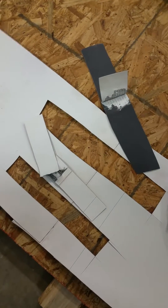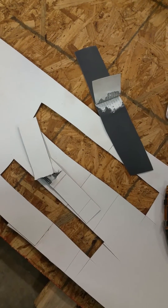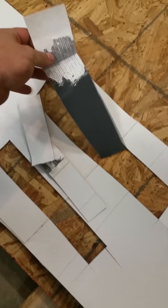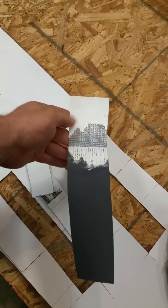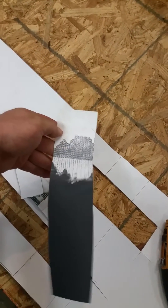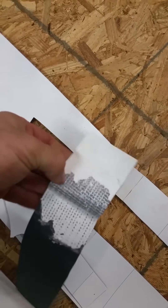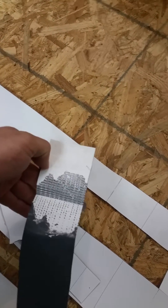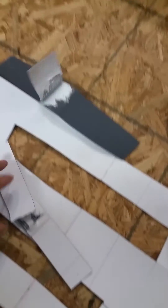This is my first attempt at hot air welding GAF's TPO. The first weld has scrim visible all the way across for maybe half an inch. I know it's probably supposed to have two inches all the way across, so I'll need to work on that.